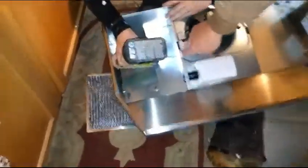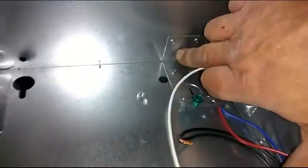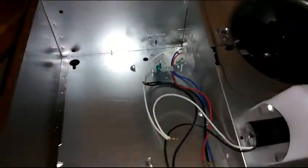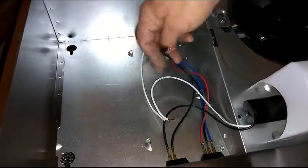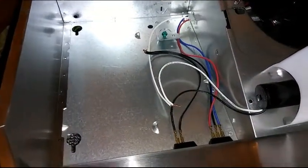This has a screw right here that takes this cover. You notice this little tab. So once you take your screw off, it'll be able to get where the wire goes into this. And we're probably going to try to go through that back instead of going through the cabinet, see if we can cut drywall and go over top and then put this over top of it and connect to the hot there and the neutral there. On the ground on that. And we've got to get a bulb.